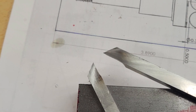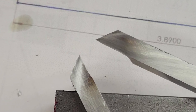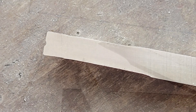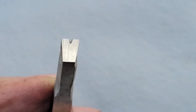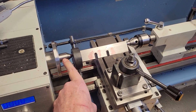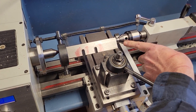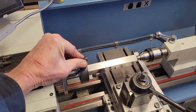I shape these tools from high-speed steel. The two used to machine the sides of the webs are fairly straightforward, but the one for machining the journal needs a little explanation. We want a wide, straight cutter, but such a large cutting surface creates chatter even at slow speeds. So we bifurcate the end of it to give ourselves two smaller cutting surfaces that we move back and forth — this results in a tool I refer to as a serpent's tongue. Now that we're happy with our cutting tools, it's time to mount the workpiece in the lathe between centers. I have a dead center mounted in the chuck of the lathe and a live center mounted in the tailstock. We have our lathe dog clamped tight to the workpiece, and I use a zip tie to secure it to the drive pin.